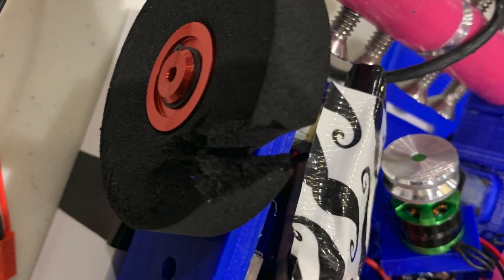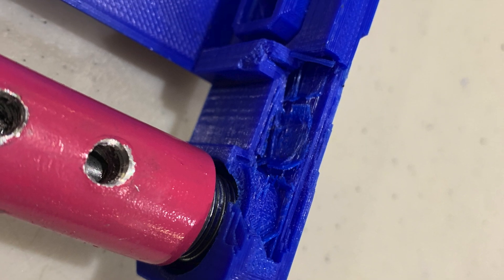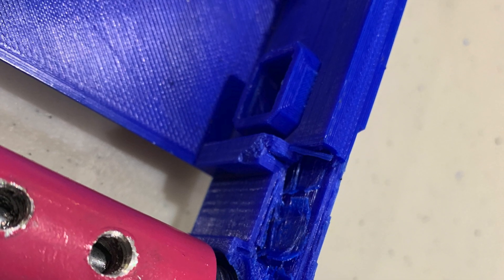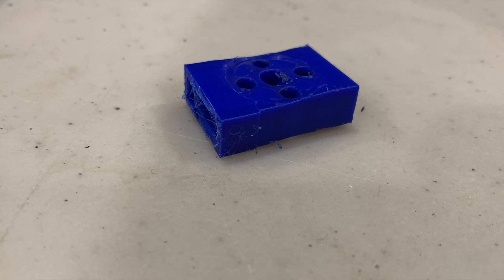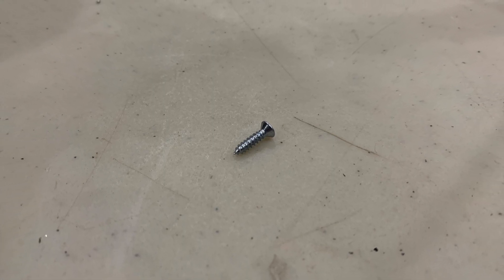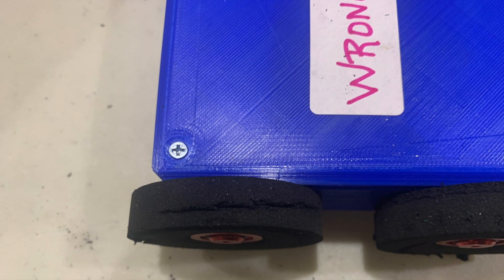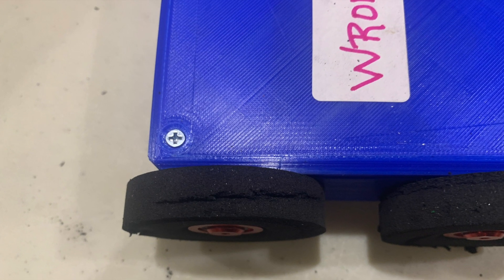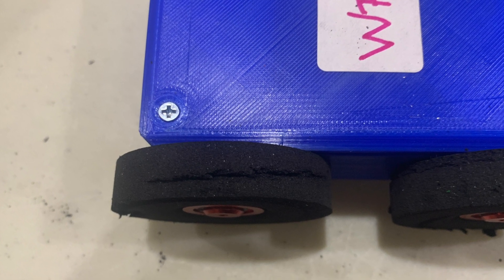After the fight I ended up with a wheel with a nice slice out of it and a chassis that couldn't support a lid. All my electronics were fine, but due to the repeated heating and cooling of the motor throughout testing and battle, the motor mount was weak enough to be broken off quite easily. Brandon from Bay Area Robotic Combat ended up giving me some coarse thread screws that can self-tap — a serious upgrade from tapping machine screws into plastic holes, which should have seemed like a bad idea from the beginning. These new screws ended up holding everything together extremely well.